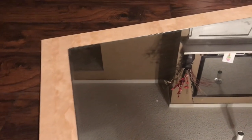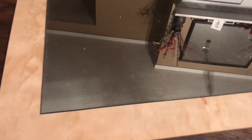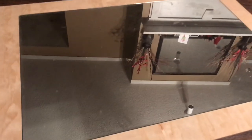Once the mirror has been taken out of its frame, it's time to build another custom one. I took the 1/4 inch plywood and laid it flat and stuck my mirror in the middle, even on all sides, and then drew out where the mirror would lie exactly. Once I've drawn that out, I can go ahead and start building my custom frame with the 1x4s around it. And once again, all measurements will be listed in the description box below.